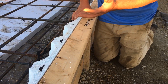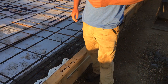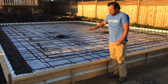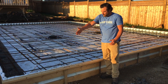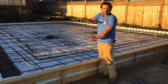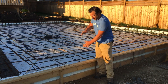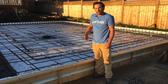I want to get into why we're using the ICF block. The engineer specs 3-inch foam up the slant and throughout the rest of the slab, bearing on 8 inches of gravel. He essentially wants 3 feet of foam coverage — so technically on the prints we'd have 14 inches and then he wants foam out further. Regardless, he wants foam around the perimeter.